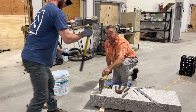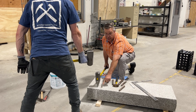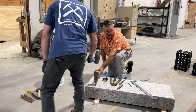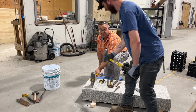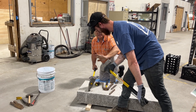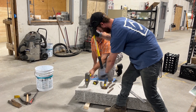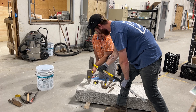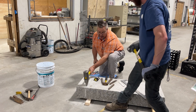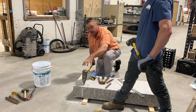Flip it over. We're using the piece of carbide at the bottom of this hammer — the other one is just steel — and we're going to go hammer to hammer, a couple of hits, and this will break. When you're splitting a piece of granite, it's important to get the vibrations down on that trace line. I don't want to hold it one way or another.